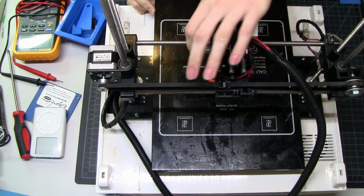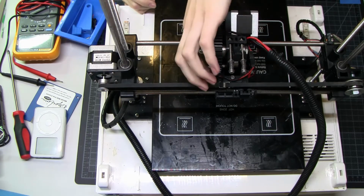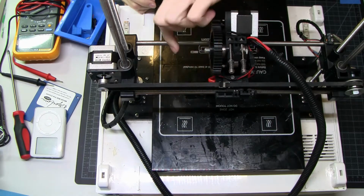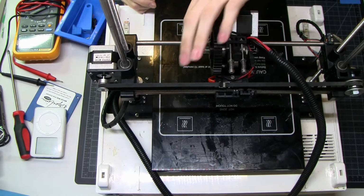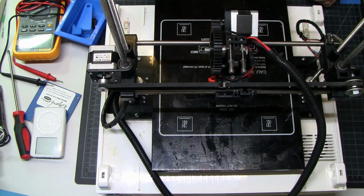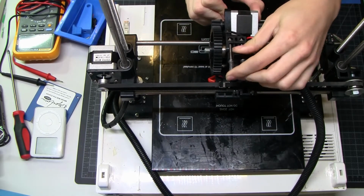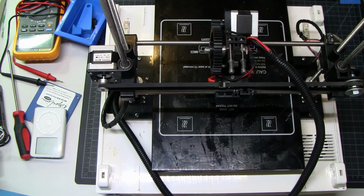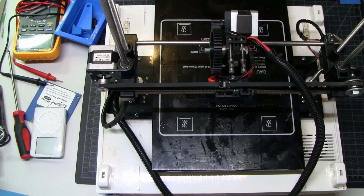Oh yeah, and as for the extruder, the heater is good. The heater is plugged in correctly and actually does work. The thermistor, there we go, is for some reason wrapped around the main extrusion drive gear. So every time that changes direction, it wiggles and gets pulled further out of its sheath. So that's certainly a choice that somebody made. The extruder itself seems fine as a design. I haven't tried pushing anything through it because I don't want to cause further problems. But the motor works. The head is filthy. The bed has clearly seen a lot of glue sticks and very little cleaning.